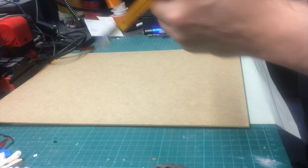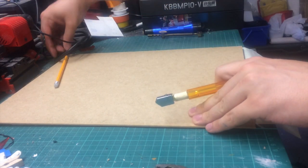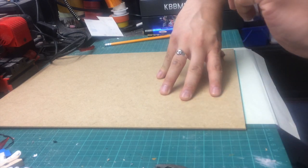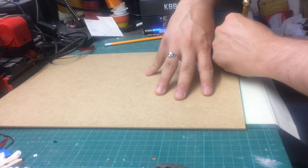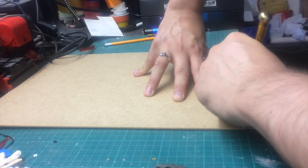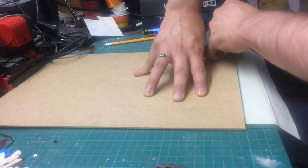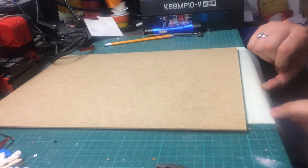I'm now going to use a glass cutter. I picked up this one off AliExpress. This is supposed to be used with glass cutting oil, which I don't have at the moment. I think because it's very thin glass, and if it all breaks I can always go and buy another piece, this will do for now. It has two edges on it — one at 60 degrees and one at 45. I've always been taught to use the 45 degree and just press and pull. This is a little bit harder for me being left-handed and because I don't have the oil, I'm just going to do a few more scores just to make sure I've got a pretty solid line. It's actually started to snap a little bit at the edge.